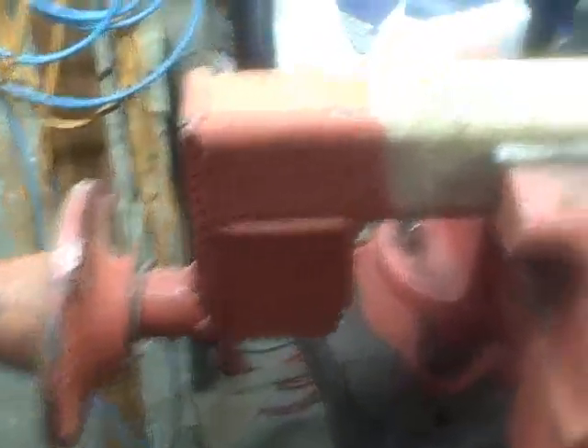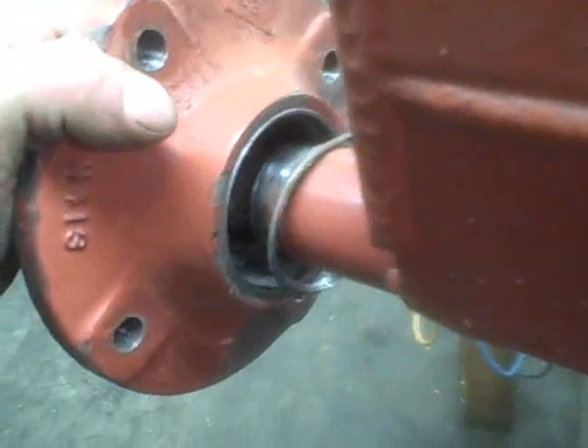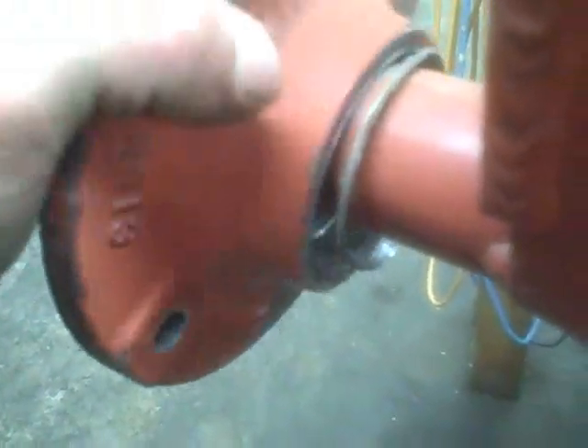There's the culprit — it's the front axle off the harrows. You can see the problem here: the bearing wore out. I don't even know why I didn't catch that sooner, but I guess that's my fault. So I'm going to get a smallish straight screwdriver and a small hammer, and we're going to tap that cap off and take the keeper nut off the end.